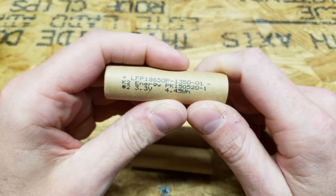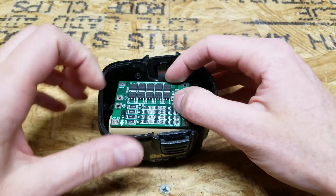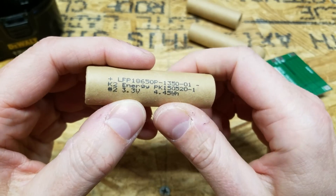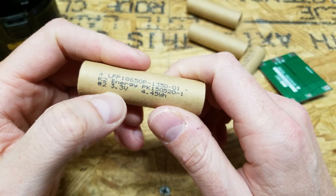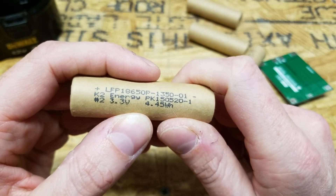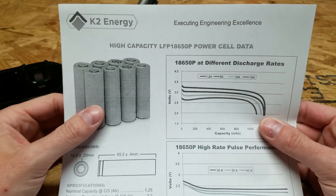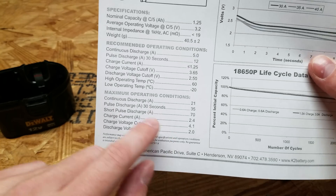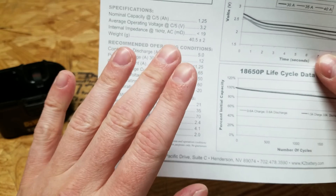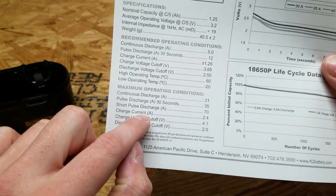So the remaining option is pretty much to go with 18650. There's actually a lot of space left over with the 18650 cells, and that's fine because I also have to fit a BMS board in here since I'm using lithium. The reason I chose lithium iron phosphate is because these cells are 3.2 to 3.3 volts nominal, whereas a standard 18650 lithium cobalt or lithium manganese is around 3.7 volts nominal. So when wired in 4S, lithium iron phosphate gives a perfect 12 volt battery replacement. The specific cell I chose was the K2 Energy LFP18650P — these are power cells with a maximum operating discharge of 21 amps. Most 18650 lithium iron phosphate cells are only good for about one or two amps, and with a power tool you definitely need more. They also have a pulse discharge up to 30 seconds of 35 amps and a surge pulse discharge of up to 70 amps.